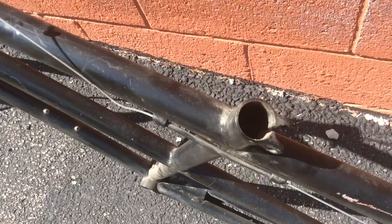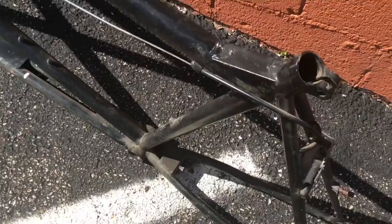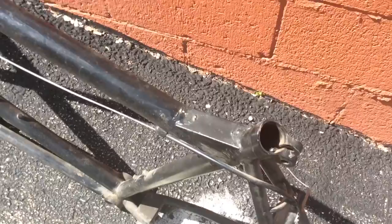Because of the heat I added with my torch — this is a brazed frame — I did have to ream out the two seat tubes, and there's a gusset there for reinforcement at that particular point.